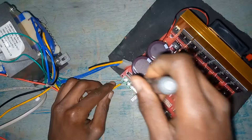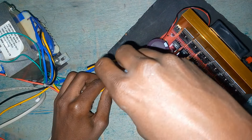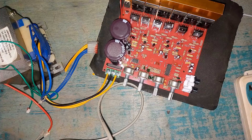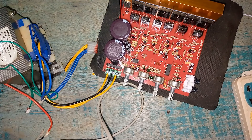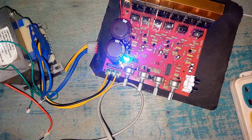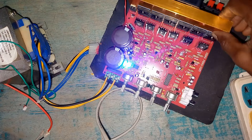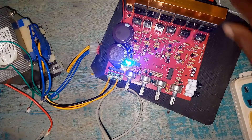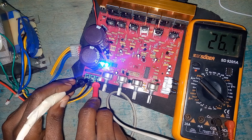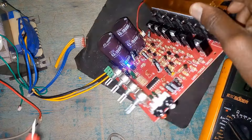We are still within range, so you can connect it where we have these connectors — yellows on the sides and black in the middle because black is ground. Moment of truth — it turns on and gives a blue light. The fan is rotating. Let me measure: it's 26.7 volts, and the other one is also 26.7 volts. So this was probably a 27-volt transformer.